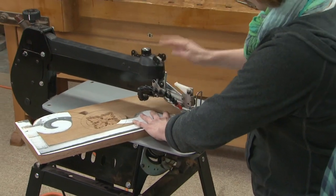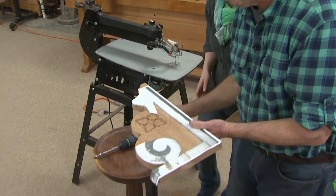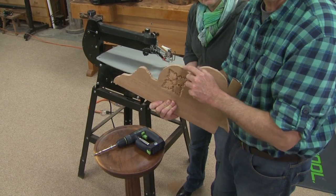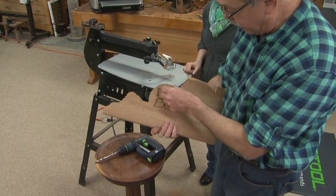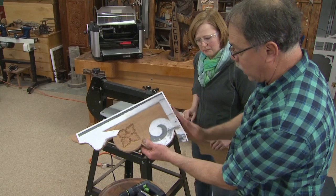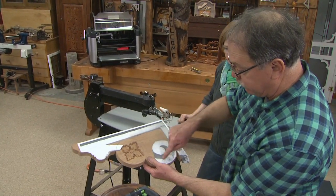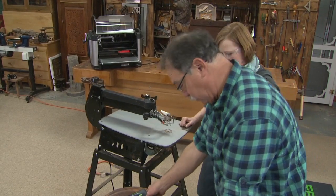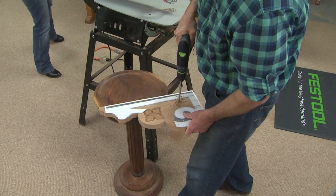Now it's time to do all the inside piercing cuts. We've got a total of six areas that we need to drill all the way through. I've set it up for drill mode — I've pierced the blade through the pilot hole now. We're going to waste away the area right in here and scroll into the carved edge of the acanthus leaf. There's always a good way to approach your work — be very careful with these delicate details. This is a thick piece of wood and I don't want to break out any of the parts.